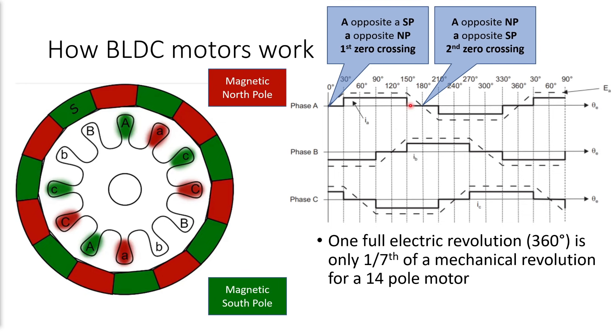There's one final thing to say about sensorless brushless DC motors: the ESC is actually measuring the voltage on the phase during the unenergized period, and it's using that measured voltage to determine when the zero crossing happens. That determination of the zero crossing is how the ESC knows how fast the rotor is rotating and when it should energize all the different phases. If there's a lot of electrical noise, that can make it difficult for the ESC to detect the zero crossing, which is what can cause things like desyncs. The zero crossing is really important for keeping the ESC in sync with the motor.